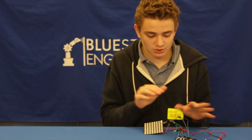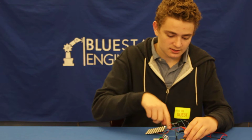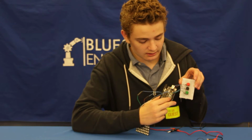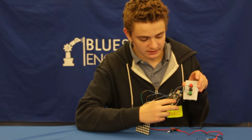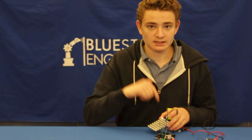There was a whole issue with the pins, like which exact pins I should input the wires into the Arduino. As you probably could see, the DIN wire from the NeoPixel board is plugged into the 8th one, and then the 3 buttons are plugged into the 9, 10, and 11, and that's where they send their information to.